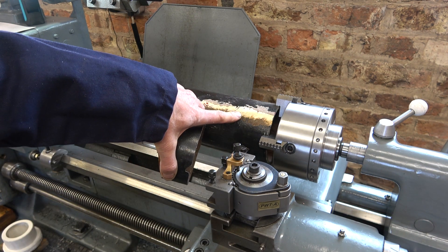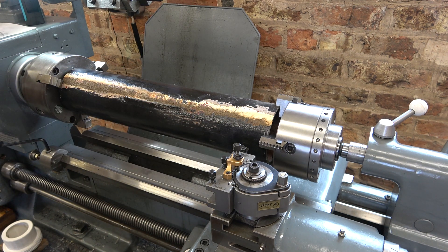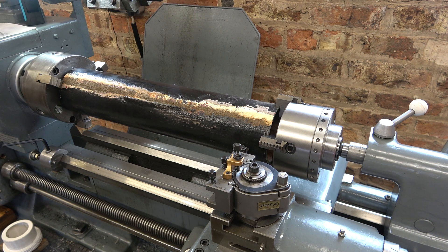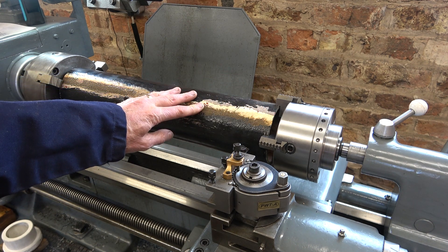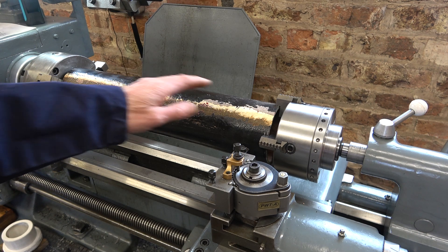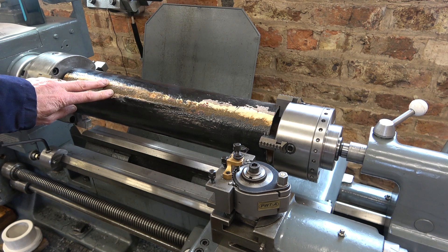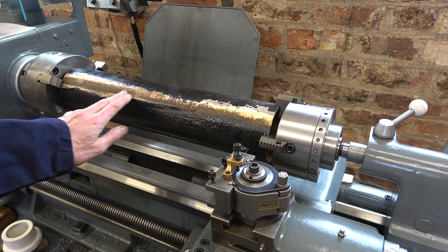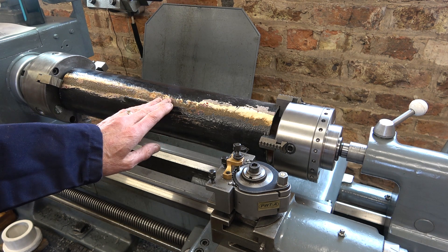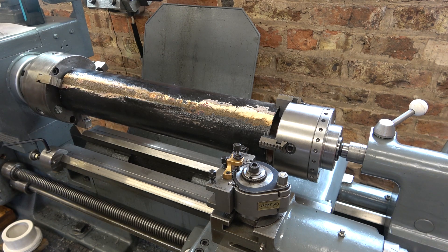By the time I've cleaned this up, I may be almost through the pipe. I need about a thread depth of 1mm, so we're already in risky territory. It may be that as I clean this up, I choose not to fully clean this area — we may leave this stripe on. Or I could cut it there because there's a raised seam here, and that would give me a chance to clean it up all round. But step by step, let's see what happens.